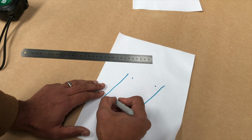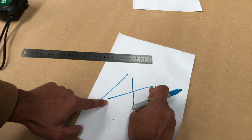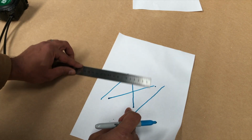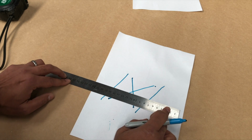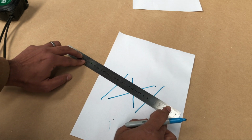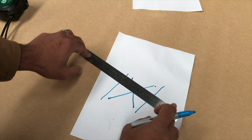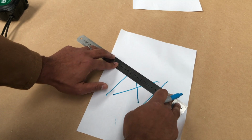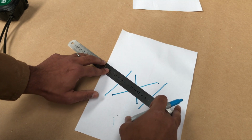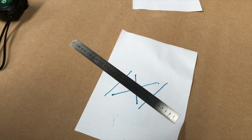So, what you do instead is you measure your distances again. And now this line is much longer than this line. So what you've got to do is move this x-axis in this direction. Tighten it all back up again, and now you'll find your x-axis travels. The whole thing will be on a cant, but at least everything will now be parallel with each other.